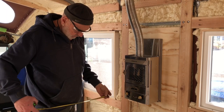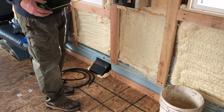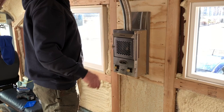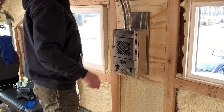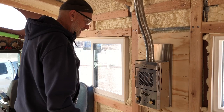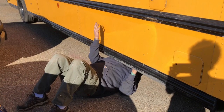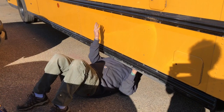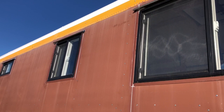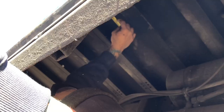All I've got to do is run the gas line up, so I've got to drill a hole in the floor. I'm a little dubious about it — my nice beautiful floor! I'm going to run the gas line on the inside of the wall and use a cover over it, so if I have any problems I can just remove the cover and access the gas line. I think I can calculate off this rib and just come over 11 inches. He's going under to check — it's between these two ribs, between those two windows, following the ribs down.